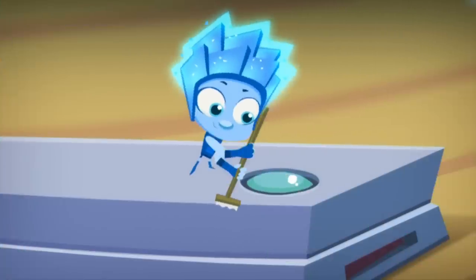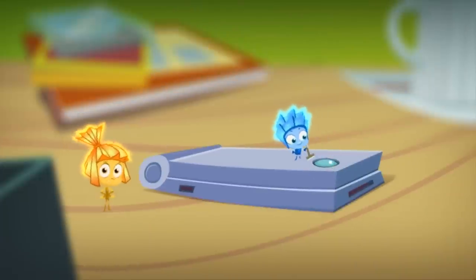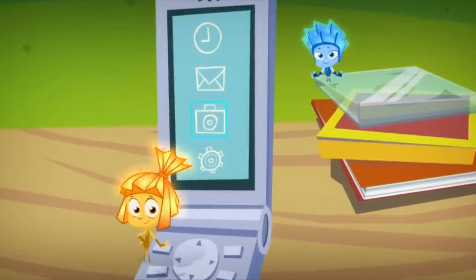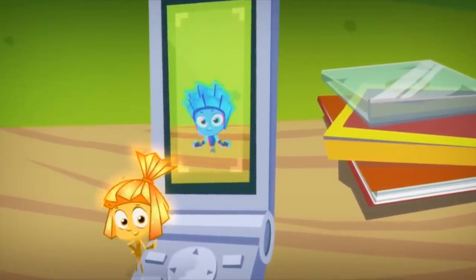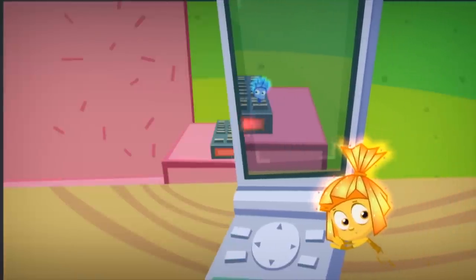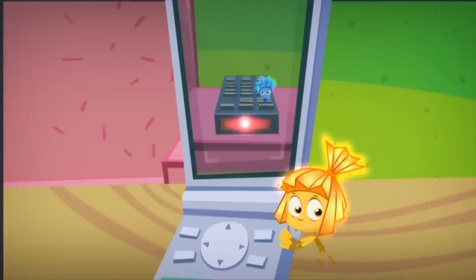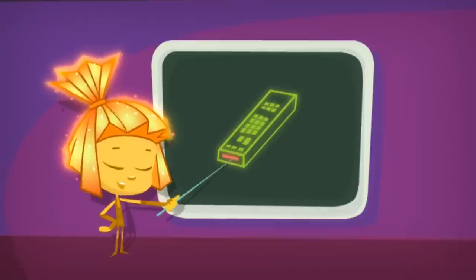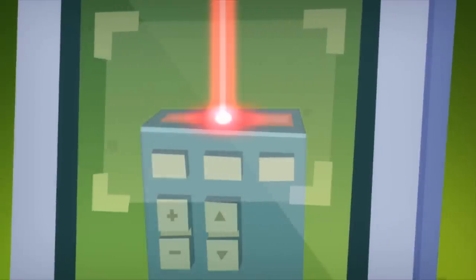If you want to see infrared rays, all you have to do is look through a digital camera. Try it for yourself. Turn on the camera on a mobile telephone. Now go ahead and press any button on the remote control and point the camera toward the front of it. You'll see a bright dot on the screen of the camera. That's the light-emitting diode working. It's letting off a special light that can't be seen by the naked eye.